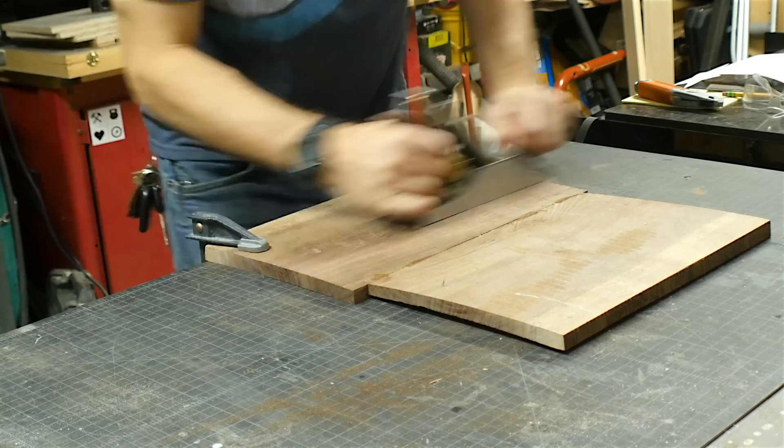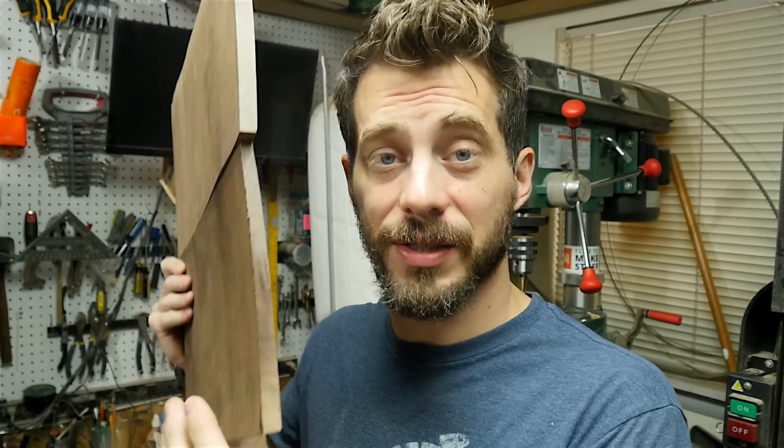Before I added the template, I tried to flatten out these pieces using a hand plane. I ran into a little issue here and I want to explain it just because it might help you guys. I don't have a resaw blade on my bandsaw — I thought what I had would work, but the blade bent a little bit while I was pushing the piece through because it's not the correct kind of blade. Because of that, the cuts on this wood are not straight; they have a little bow in the middle. Originally I didn't think that was gonna be a big deal — I would just send them through the planer to flatten them out. But the thickness of this wood is smaller than what my planer can plane. If I had a drum sander I could send it through there, but I don't have one. I tried to use a hand plane but that's not really working, so I'm just gonna have to go with some cup on these pieces. This is just a quick decoration, but if you were gonna try to make furniture you definitely want to get the correct blade and make sure you have another way to flatten these boards.